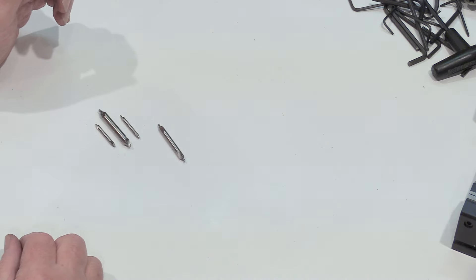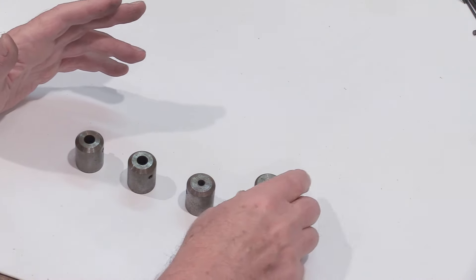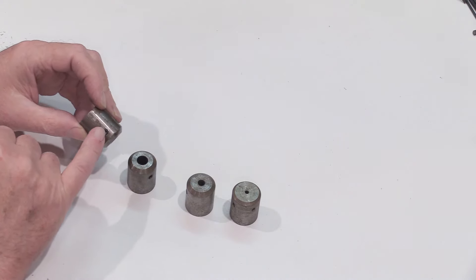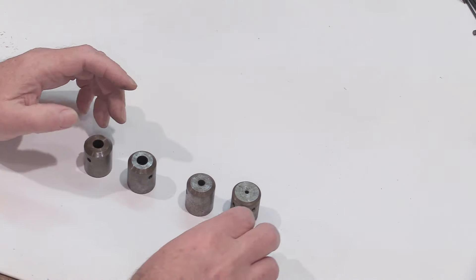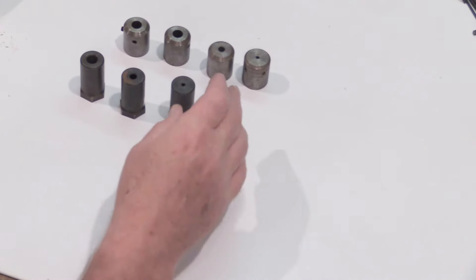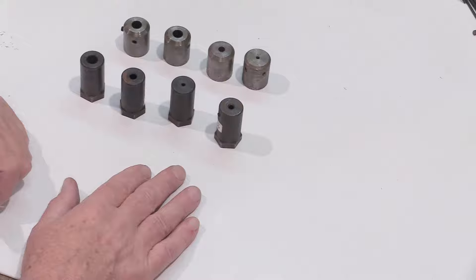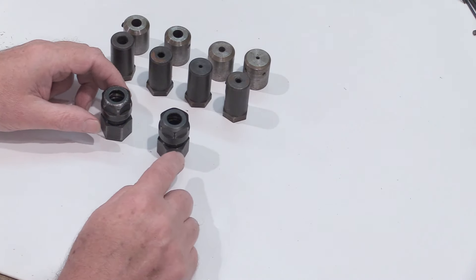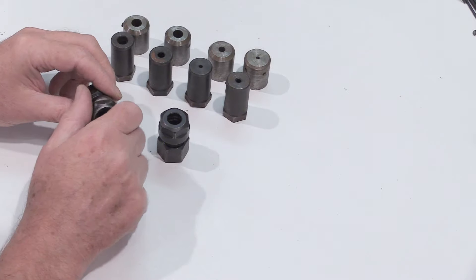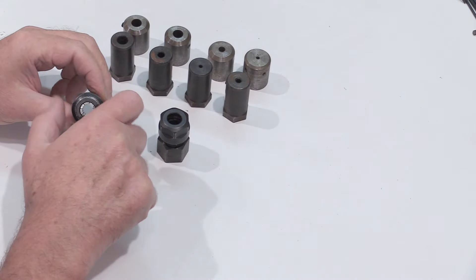A nice assortment of center drills in the three sizes that Sherline makes. There are many ways to hold tools — particularly end mills. These are the standard holders that Sherline makes with a set screw, and I'm supplying all the different sizes: three-eighths, quarter, and eighth inch. Then because you can never have enough options, I bought the A to Z equivalents of those tools. These are ER16 collet holders — I'll be supplying three collets in three-eighth, quarter, and eighth inch. The collets just snap into the nut, put your tool in and tighten it up.